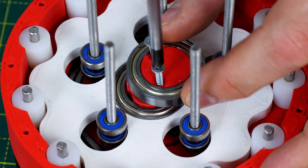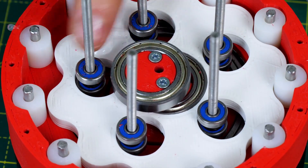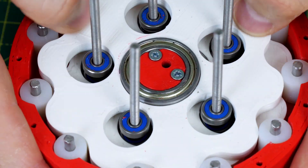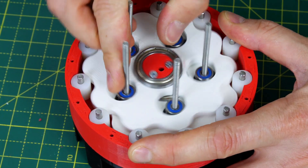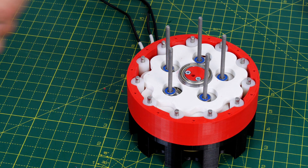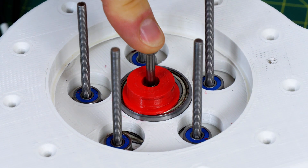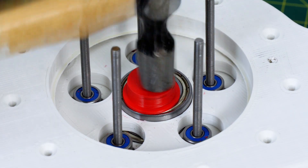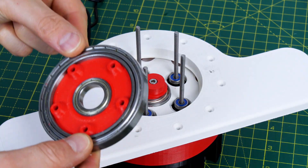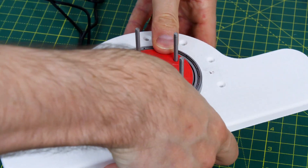After that it's time for some 5mm spacers and the rest of the bearings for the second disc. In the middle there's another offset cam which is offset by 180 degrees, and that's to support the second disc moving in the opposite direction so the whole thing doesn't vibrate. A bit more silicone grease and it's time for the second disc — and so far so good, that seems to run pretty smoothly with both discs in and it's definitely back drivable. The lid has a number of holes which support the top of the shafts for those bushings, and those holes don't go all the way through to the top. We can now fit the top cap for the cams, bolted through to that nylon lock nut with an M4 bolt, which is a very tight fit. The top of the whole assembly has two bearings — one for the output and one to fit on that top cap that holds everything centrally.